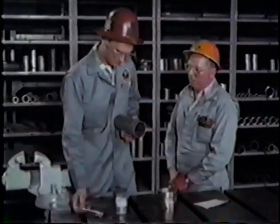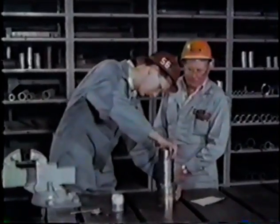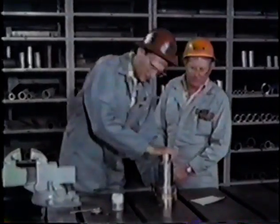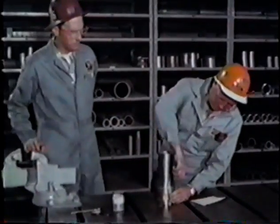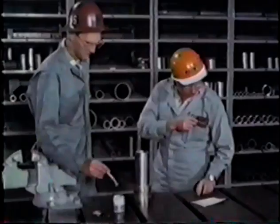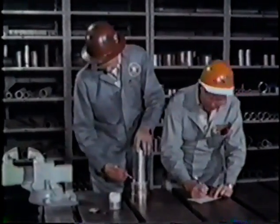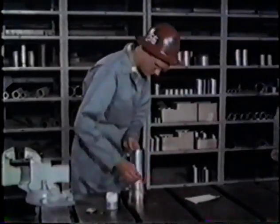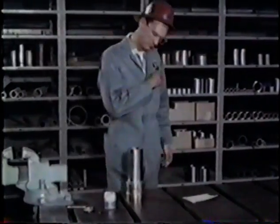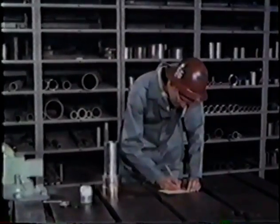Assemble the joint using the reference marks. Add flux to the joint face. The action of flux is a valuable temperature indicator during brazing. If necessary, support the joint to avoid stress during brazing. If a joint can't be brazed within 16 hours after fluxing, disassemble it and reflux it before brazing. Fill out the quality control papers, and the job's ready for the brazier.